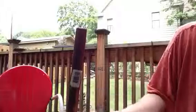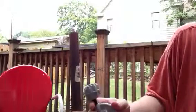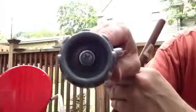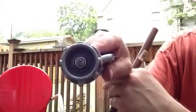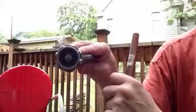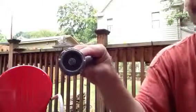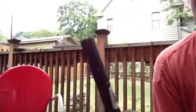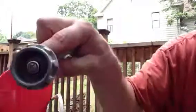There you go — it's cut. We ream that out with our cutter. And don't forget, your cutter has an extra blade in the center there. So if your cutter blade goes bad, you have an extra one — unless you've already used it. That's how you cut and ream your pipe, and find your extra blade.